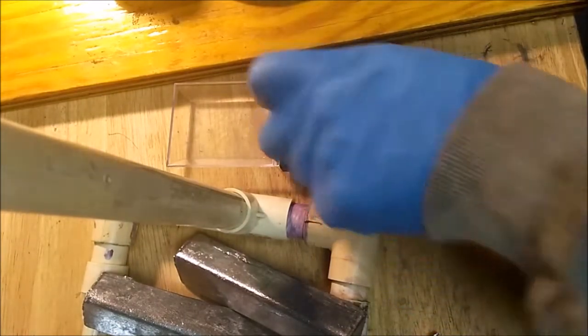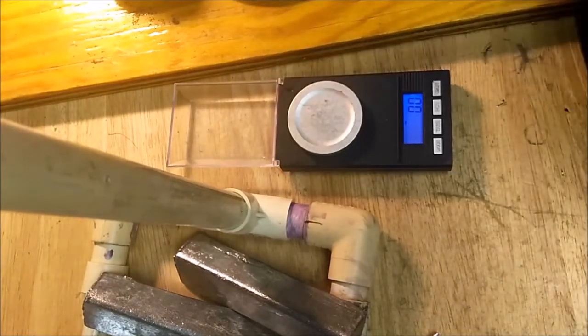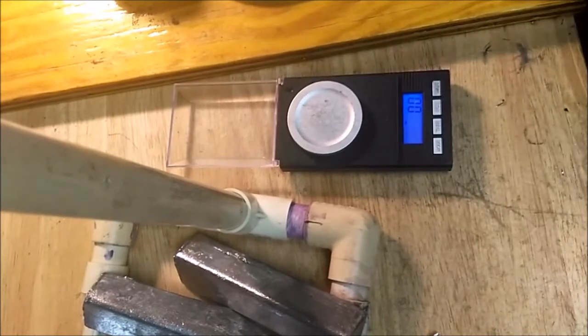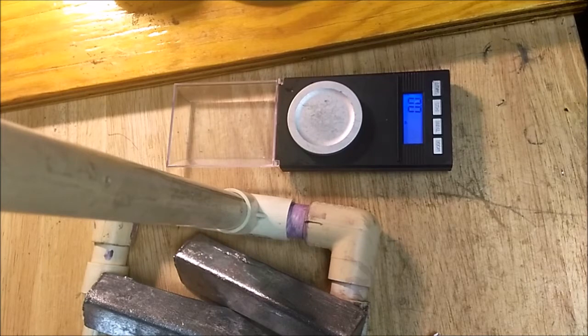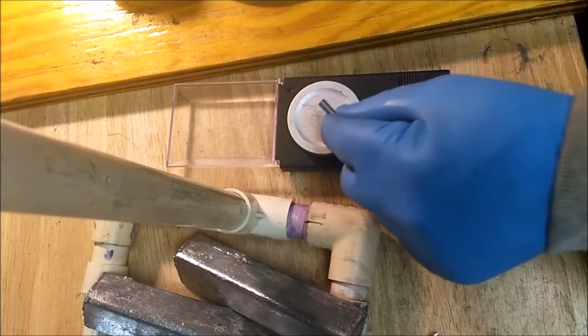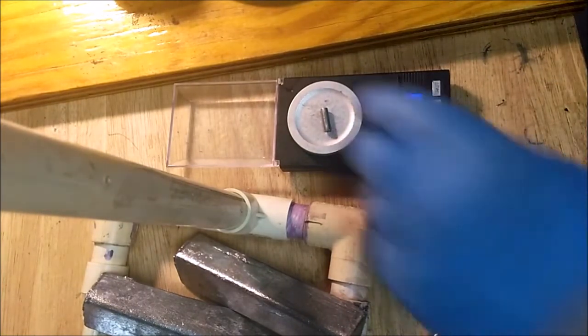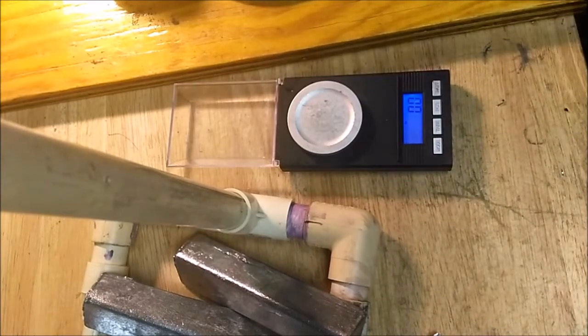45.2. If I can get a few of those consistently, then I'll just run a bunch and then do what I normally do, which is clean them, oxidize them, and then weigh them. Because when you're cleaning, you're swishing them around in a jug, and the lube gets washed off, and oxidizing, you got the vinegar eating into it a little bit. So it can lose a little weight.